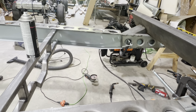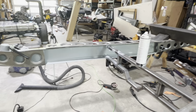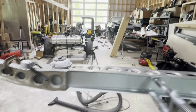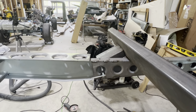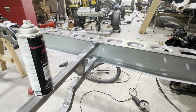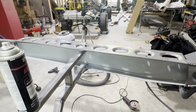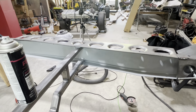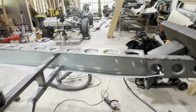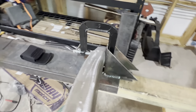You can see I'm tacking in the pieces and parts on that side as far as the boxing plates. I got the boxing plates from Wolf Metal Fab — real nice stuff, I'm happy with it. You're going to have some gaps in that kind of thing, but nothing's perfect, just get on with it. The rear's clamped in over there. At the back there's a gap between where the center boxing plate and the rear boxing plate's going to go. You need a little gap to weld. I'm going to have to space it around this center crossmember, which I think is going to be a pain in the rear. So I went ahead and cut the thing and will have to fit, fab, and weld around that.